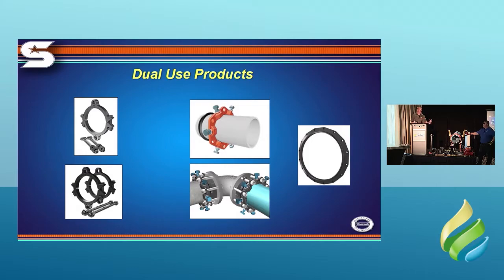If I'm designing, and before I worked for a fitting manufacturer, I'd have always gone to a C153 fitting. And as Craig said, it's because it's available. You've got more options in that readily available. There's no lead time. You can go to your local distributor. They will have it on the shelf. Certain municipalities and cities have comfort zones, and they say, if it's working, why would we change it? There is that aspect as well. But in our opinion, if you want more of it, you want it quick to show up, you want to go C153. That's because 95% of North America is C153. There's a few standouts, and everyone has their reason. But from a technical point of view, there is absolutely no reason not to use C153.